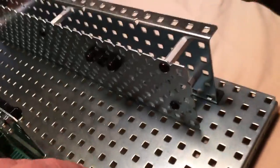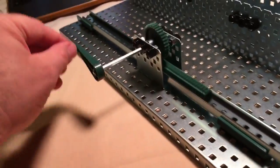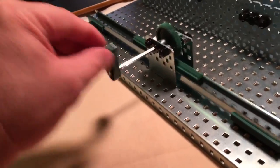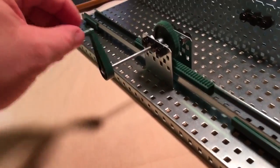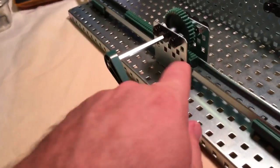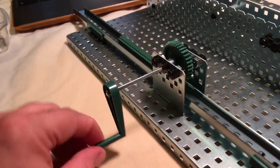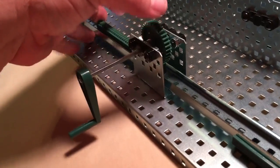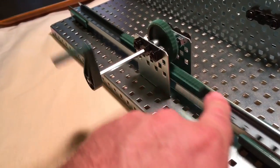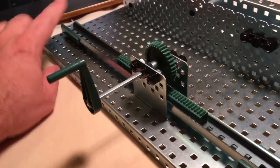There we go — rotational taken to linear, that is a rack and pinion. This is mounted down onto the base plate, so you need some kind of support for the gear at the right height so that the gear meshes into the rack, and then slide rails to guide the slide.